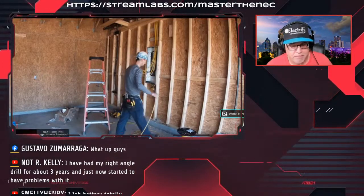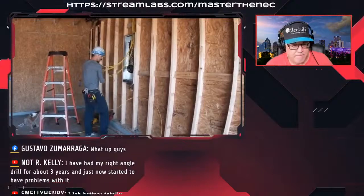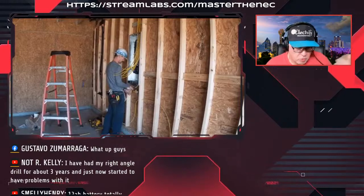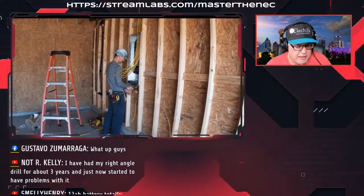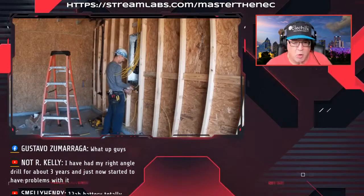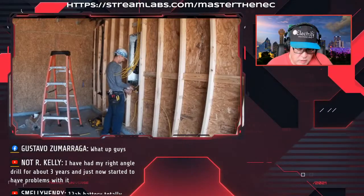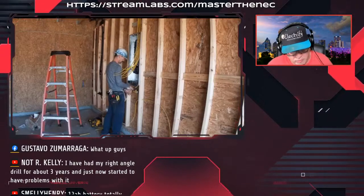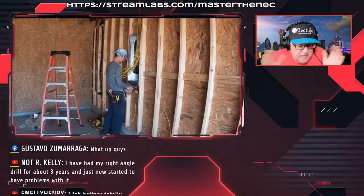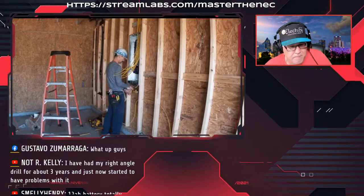And on 12 wire, normally I wouldn't put this one in. It wasn't necessarily a code change, I might as well also mention. I'm not sure what cycle he's under. Since his video was created in 2020, it's either 2020 NEC or 2017, both of which required that the garage branch circuit, where you had a garage, had to be 20 amp, at least one 20 amp. So that's not new. I get where he's going, and he's probably not a code expert, and that's fine. He doesn't need to be. He's got a working knowledge of it, and he's putting 12 in, so he's good to go.